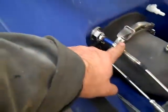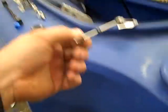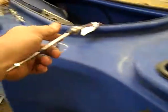This is the original steering cable that I used, and I actually had another cable made for it that would work just as good. I have a little extra material in here — I could have taken about eight inches out. But once I got that cable here today I decided I would try to set that up as my throttle cable. I know this is a transom through-hull cable — generally they use something lighter on the throttle cables — but we'll go big boat marine on everything.